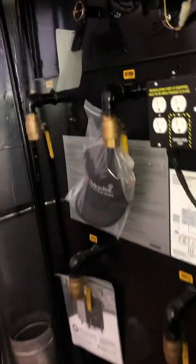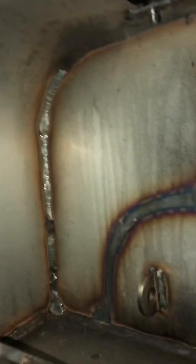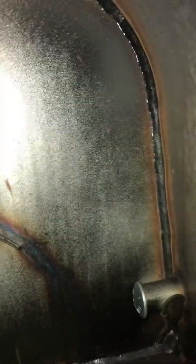Anyways, if you've seen our G100 walkthrough, what they're doing now is all stoves will come with the bypass plate and hole in it. If you go to install the kit, this is your loading button. That comes out and the handle goes there. There's a tab already welded in. The end of your shaft goes there. You take that bolt out, the shaft goes through. And the reason they changed insulation is so now you can just simply pull this one panel, hook the linkage up, not messing with the big wad of fiberglass in your way.